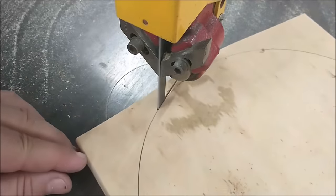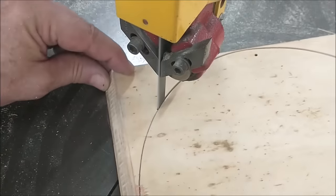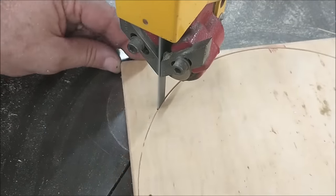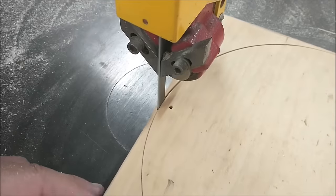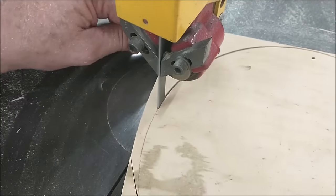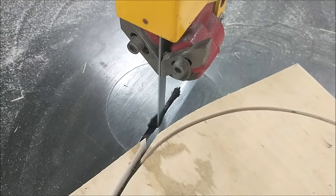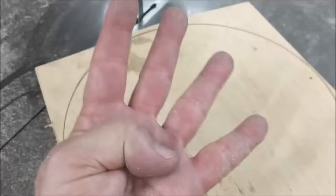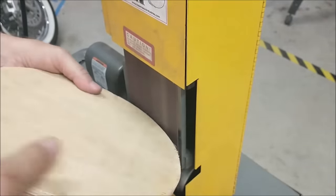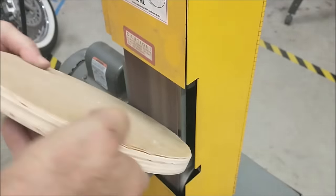You just got to love a bandsaw. I'm channeling my inner Jimmy DiResta here — if I was really doing that, I'd have the guard about six inches off the table and be freehanding it. If you haven't watched his stuff, watch his stuff; he's an amazing guy. The plastic buckets are molded, so the bottom edges of the wood need a fairly decent chamfer or radius, whatever you want, so long as it clears.